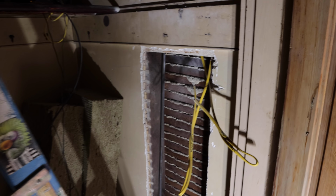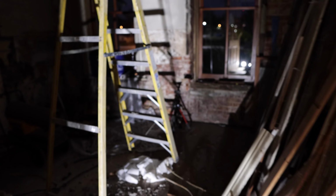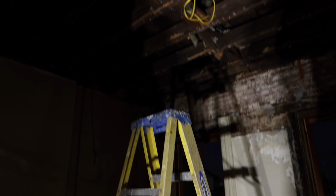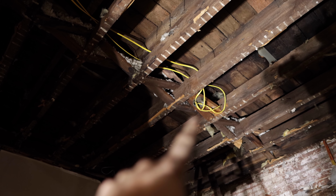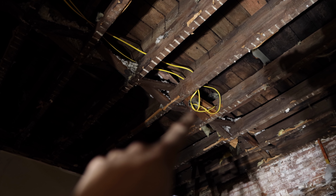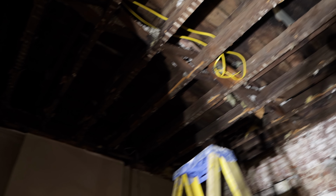So yeah, I've got two cords popping through here. One is for the library and one is for Kim's room. And these are going to be the source wires, or the power wires, that are going to be the main lines. And you can see up there some of the wires I've got going on. That's the box there, so that'll be the light. One of those lines there is the power or source wire, and one is the switch wire,